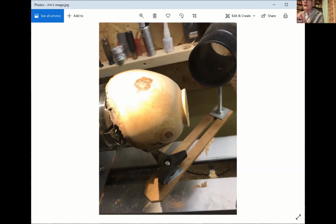If you have a wall behind the lathe, as you've got there, Jim, which is what I used to have, and I had a shelf about where you've got your little shelf there, but a bit deeper. And what I did, I got two bits of MDF separated by the thickness of that shelf. And I just slid it over the shelf. And that would support the inlet. Nothing on the lathe bed. I could swivel it about quite easily on that shelf. The shelf you've got there is too narrow, but maybe you could extend that. Yeah, that's actually quite an old picture, and I have, as it happens, extended that shelf already.